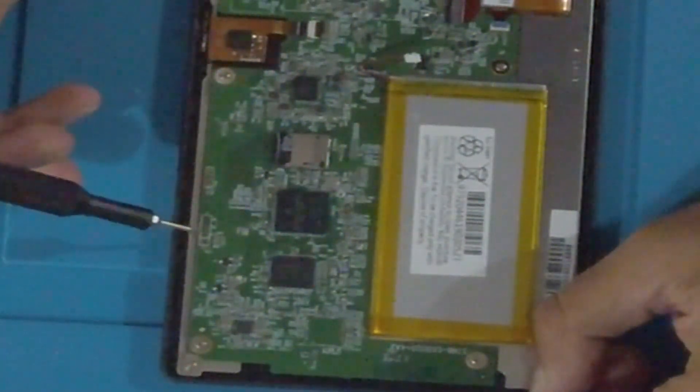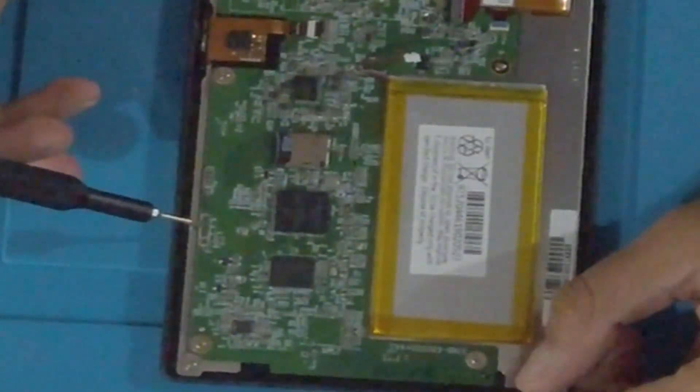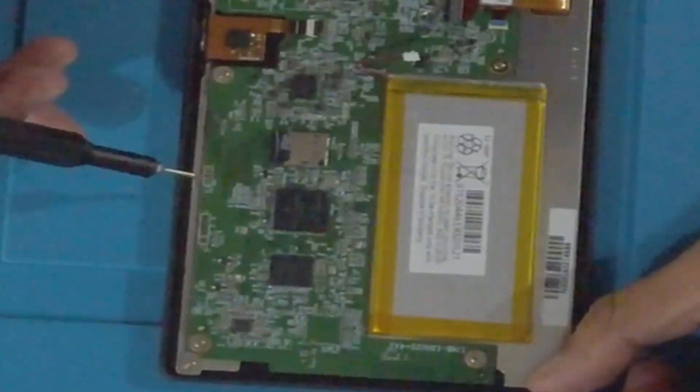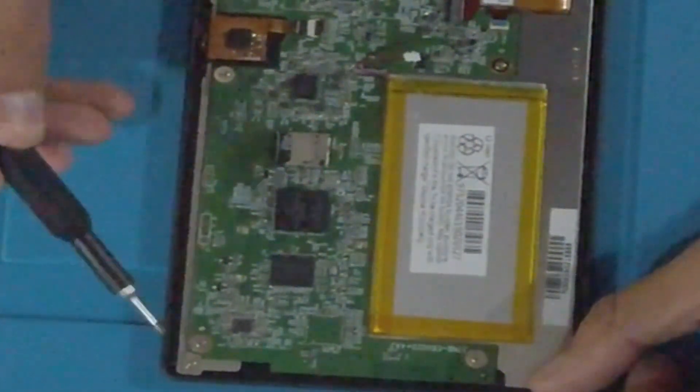Here is the voltage, and the transmitter, which will go to the receiver on the radio side. The receiver on this side will go to the transmitter on that one, and this is ground. I believe it was noted that you don't use the ground pin here, but instead use these other pins as ground, because those are also ground.